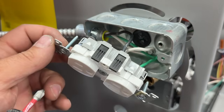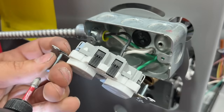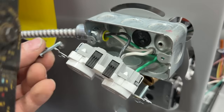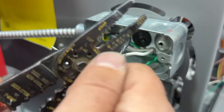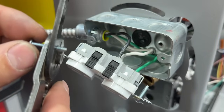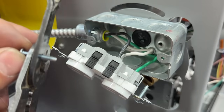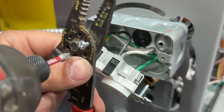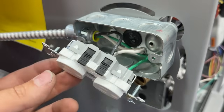One more trick here: this mounting screw is way too long and it's going to hit our MC cable. A lot of people don't realize that pretty much any wire stripper has a built-in tool for cutting screws. We thread the screw into the correct slot, thread it to the correct length, then simply squeeze with both hands and it cuts that screw right off. When we unthread it with a screw gun, it cleans up the threads and the screw is ready to go.